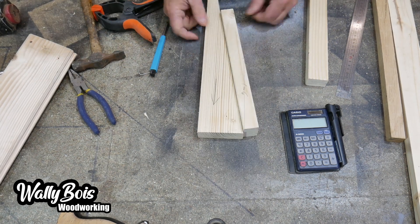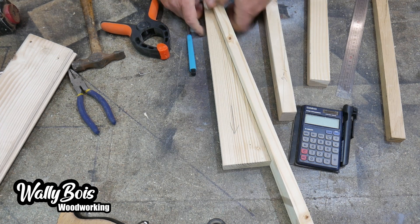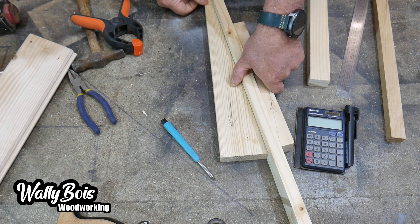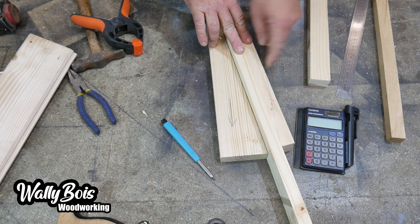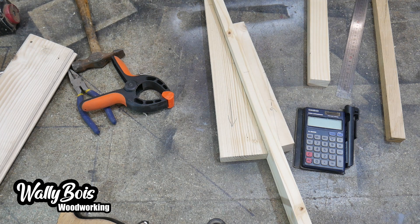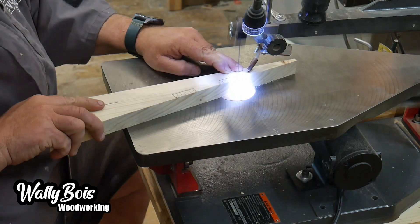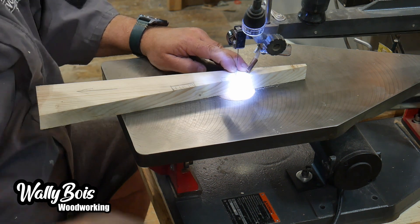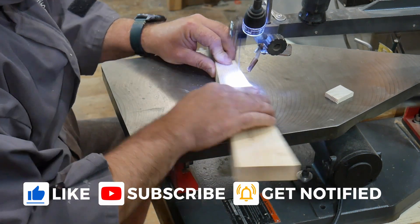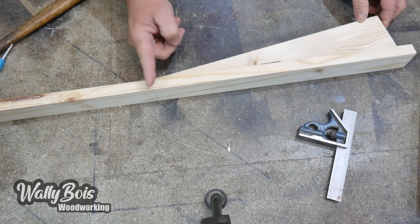There's more to do. I purchased two hand grips for this job, so we're making the jig to suit these grips — you'll have to make the jig to suit your grips. We need something for the grips to grip against the piece of wood we want to have the scarf joint on, so we can grip it onto the jig itself. We're marking it so we can cut out a clearance for the shoes of the clamps. We took it over to the scroll saw to cut out those clearance slots for the hand grips — one and then on to the second. There you go — that looks like a good one.